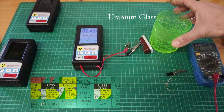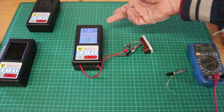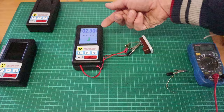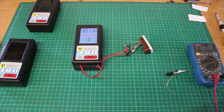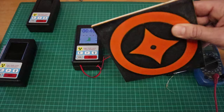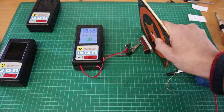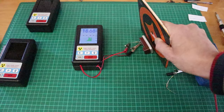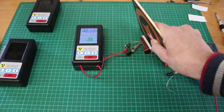With the SPT11A connected via alligator clips, something is pretty obviously going on. One thing I don't like about the BR6: it doesn't have a counts-per-minute option, which kind of sucks. We have to improvise with these microsievert values, which aren't at all correct, but it's just what we have. Let's bring in a hot source — a uranium glaze tile, a kitchen tile, pretty spicy actually. The BR6 per factory setting maxes out at 40 microsieverts, which is not a lot — and we're there. I prefer using the BR6 as a detector for weak sources anyway.